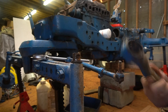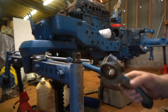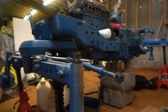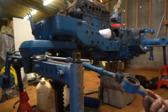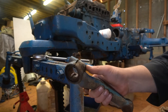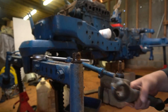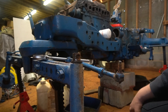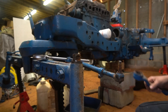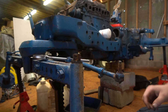Now on this tractor these arms are side specific — the bolt will go towards the rim. On a regular tractor I don't think they are, I think they're the same for left and right. That shiny spot right there — they had too wide of a tire on here. I think they had a six-and-a-half-inch and I think factory was supposed to be five. Anyway, there's the arm off. Woodruff key.